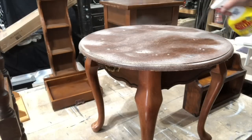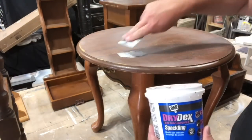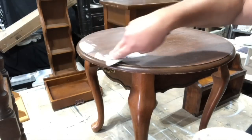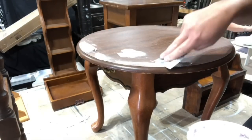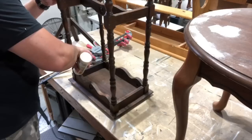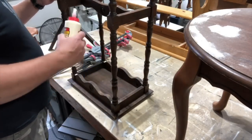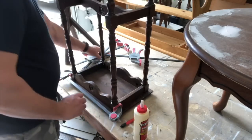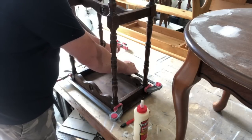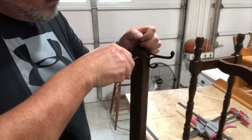After cleaning the top back off with some crud cutter, the marks were a little too deep from getting that super glue off. So he's going to end up having to spackle a couple spots — it's just easier to fill them in than to sand it all the way down. To fix the wonkiness of this little side table, he's just going to take some Titebond glue in the corners where they meet and then take some clamps and let it sit overnight. And then for this coat rack, he's just going to remove the hardware because that'll get a fresh coat of black paint.